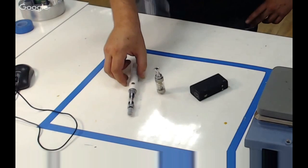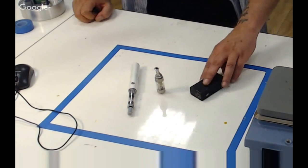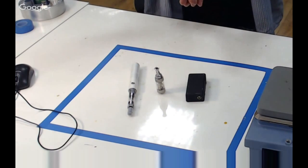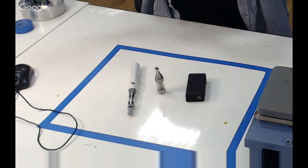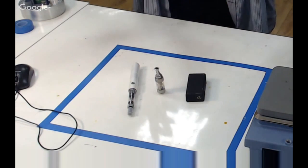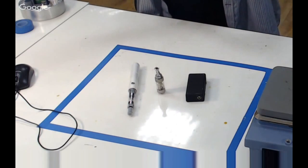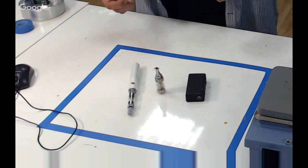When we started to look at these with an Irish company called Liquid Solutions in excess of a year ago, the market was primarily around 5-watt devices. Now, I'm going to have to be slightly technical to explain this. Your iPhone draws an average of 0.2 watts over 24 hours. It's not a lot. This is what the battery industry is here for. 5 watts in an e-cigarette obviously seems like an awful lot, but that's 5 watts that's used maybe 5, 10, 15, 20, 30 seconds an hour. So the average power use of these original 5-watt devices is in the range of about 0.1 watts, about half of what a phone is. So relatively achievable for what we're doing.